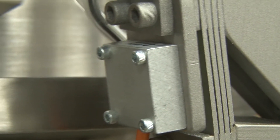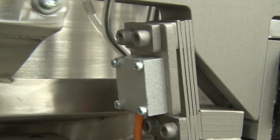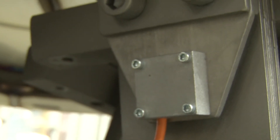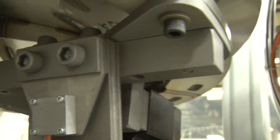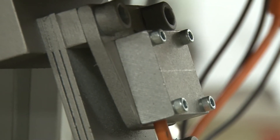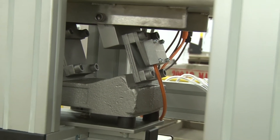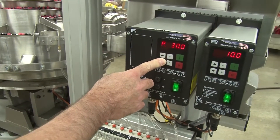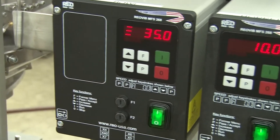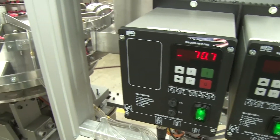We have other various examples of accessories that we utilize with the feed systems. This is an accelerometer that you see here. What that does is it measures the amount of weight and stress that is being forced upon the springs. Normally when you fill up the vibratory bowl with parts, you would turn the variac up to speed the bowl up to give it more force to get all that weight and product up and out of the bowl to continue running at a specific speed. But then you would have to turn that bowl back down because it's running too violent when you get low on parts. What this accelerometer does is it measures that weight and stress on those springs, and will compensate by speeding up and slowing down with the controller to allow it to run at a consistent speed.